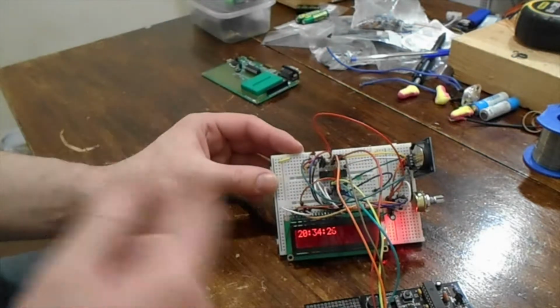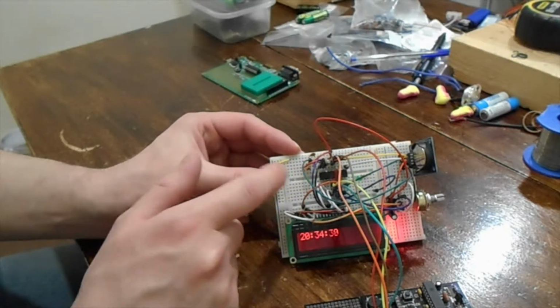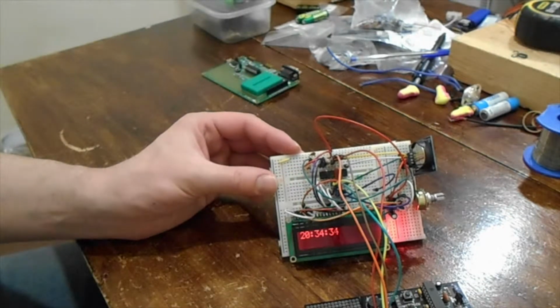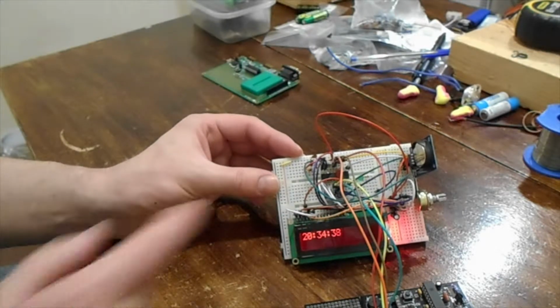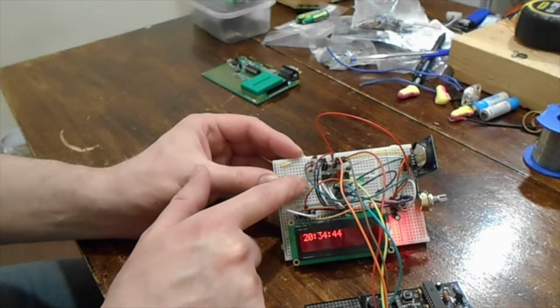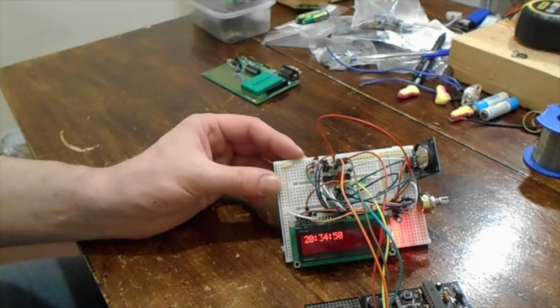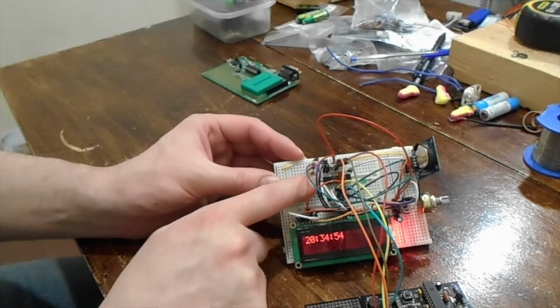And round it goes. The chip itself is actually connected to a very high precision 32,768 hertz crystal, which is a watch crystal. If you do the maths, you divide that by 4, which is what the internal latch does for the processor, then divide it by 256 to go into the timer 0 register. Well, every 32 increments of timer 0, I believe that setting, or 60, whichever it works out to, is exactly a second.